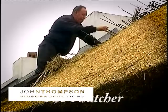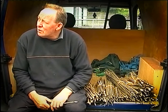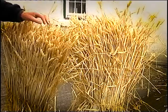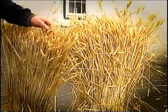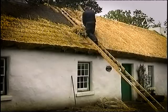The man doing the thatching is Jerry Agnew from Hothel. We thought he was using barley straw, but it's wheat straw — straw from Ballymadonna. It has to be thrashed, lashed, and combed. It has to be vined first of all, otherwise the straw would be broken. It has to be bent and lashed to make the right sort of straw.